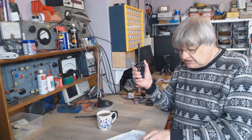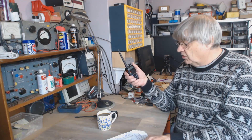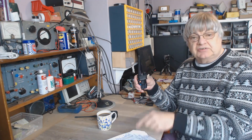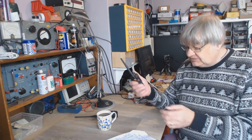What I've done is put this aerial on the Nano VNA, and on 136 MHz it's resonant, and on 465 MHz it's resonant. At any other frequency the SWR is all over the place - really high. Just out of interest, I'm telling you that.